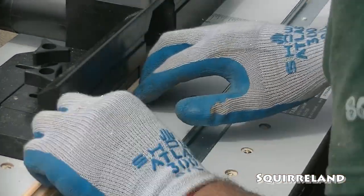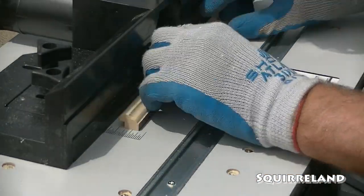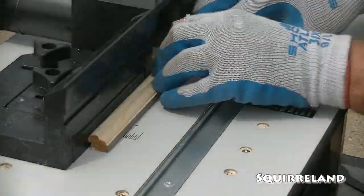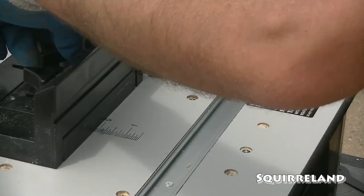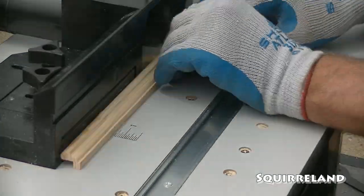This last pass makes a notch on the bottom so that the front can hang over the edge of the plywood and cover it. Initially we were cutting out the full amount of the notch, but unfortunately it was causing the boards to splinter. So we ended up doing two passes to keep this from happening. The first pass would start the notch, and the second would hog out the rest of the material. Here is an example of how the boards were splintering. It won't stop me from using this though — it is for a haunted house after all.